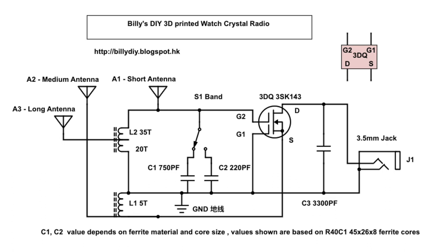The formula people use for the source-pole tap differs. Some use 1/12th of the number of turns counting from the grounding point, others use 1/6th of the total turns — it's really up to you to test it out. The number of turns shown in my circuit diagram is just a reference; depending on what type of ferrite core you're using, you may need to increase or decrease after trial.